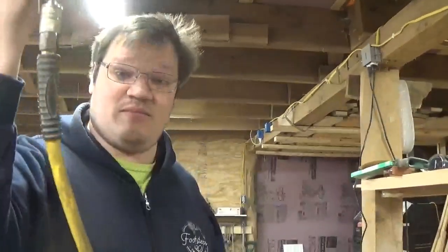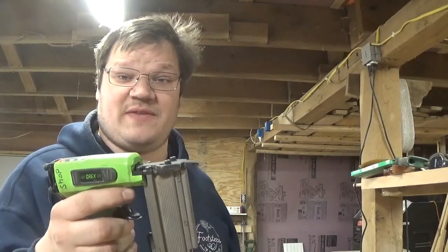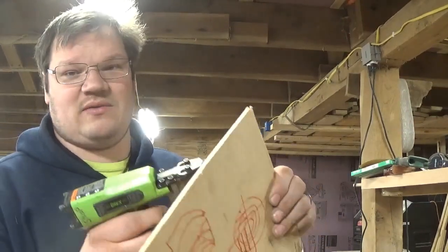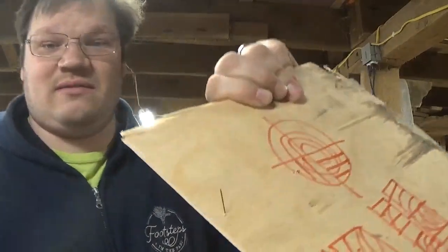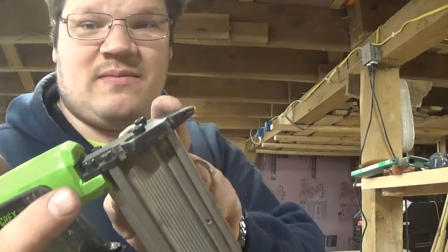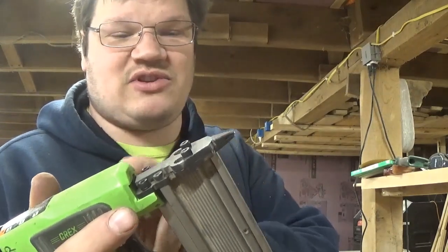Okay, plugged in, oiled, fixed. This is ready, it's live. Don't shoot yourself in the eye, kids. So I'm gonna give this a little test run. I got a piece of wood, I'm gonna put it at an angle, and let's see what happens. So I got a pin came out, that's good. Went all the way through, almost all the way through the board, I was able to pull the pin out. And the big problem, my hammer retracted. So my bumper was bad, hammer retracts now.